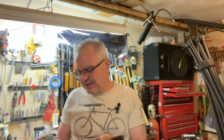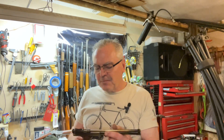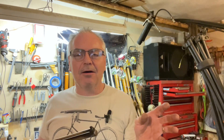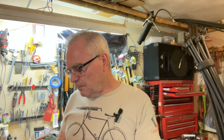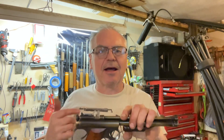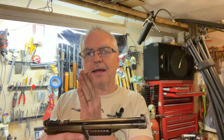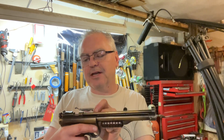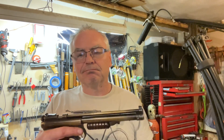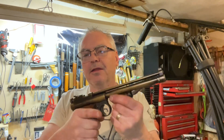It was giving me some fits getting it working, but I persisted and I have overcome. I did get a kit from Henry, and the kit was really good, but there were some problems with some of the pieces I had to resolve beyond the seal kit. Down inside, right around in here, there's a little valve body that's actually soldered in, so you can't get it out to work on it. There's an inlet valve that when you pump, moves back and lets air into the little air chamber, and then there's an exhaust valve in the back. The seat for the inlet valve was pitted, and when I put everything together and pumped it, as soon as I unpumped, all the air would bleed right back out again.